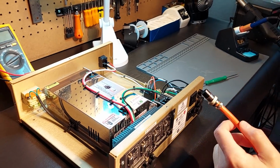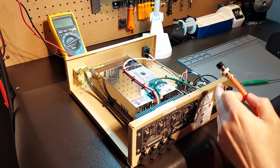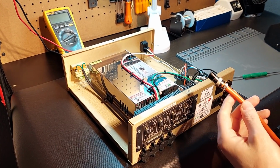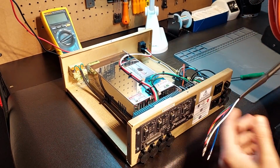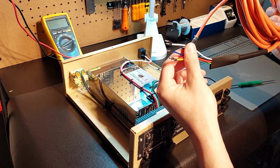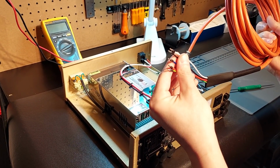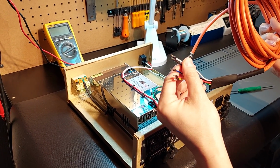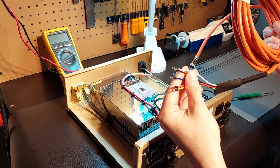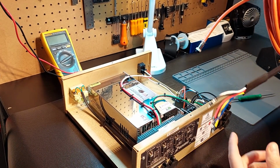It will be properly shield drained to the base of the power supply's chassis, which again is of course grounded. And the system's done. He just then connects his end leads following the wiring diagram on the actual enclosure, and he's set to go to connect to his VFD. I will then supply the documented email so he'll know exactly how to wire the actual VFD and program it, and he's ready to go to town.